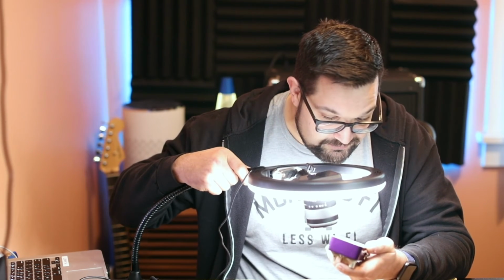That's it. All right, so here's the deal. I thought maybe it was one of the jacks and that in fixing the input jack, I had accidentally unfixed it. Nope, that wasn't the case. Jack's all good. Then I thought maybe it was one of the chips, wasn't in all the way, was in backwards, leg wasn't down. Nope, chips are good. Then I started poking around on my connections with a multimeter, just making sure that connectivity is where it's supposed to be and not where it's not supposed to be. And all the grounds were good, the power was going to all the right places.